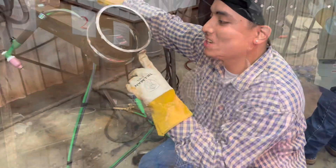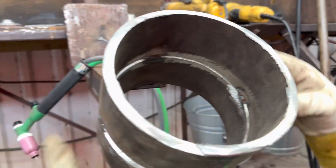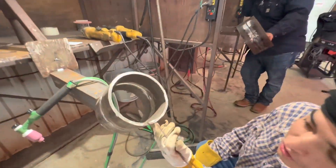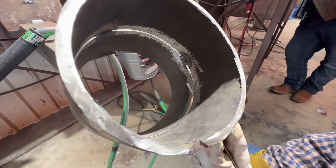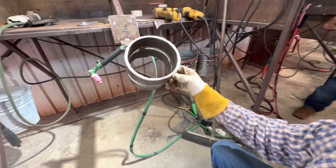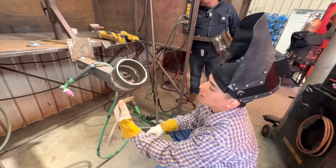In the 6G position I have three penetration tacks: one at 12 o'clock, one at 9 o'clock, and one at 3 o'clock. The bottom is left open so I can start farther back. I like to start a little off-center, around the 5 o'clock mark — it makes the hard side easier since I spend less time on it.